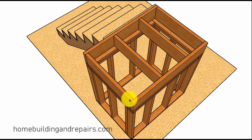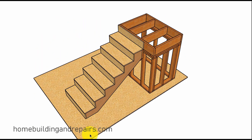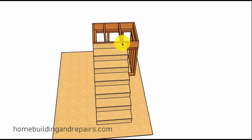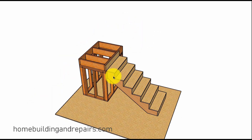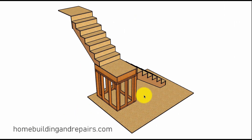Just don't forget that the grain of the plywood usually runs perpendicular to the joist. For those who don't know — let's say we have a 4-foot by 8-foot piece of plywood — the 8-foot long direction needs to run perpendicular to the joists, crossing over them. You can run it in different directions; I've read a lot on plywood, but check with the manufacturer to verify the information I'm providing.